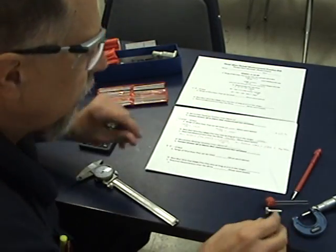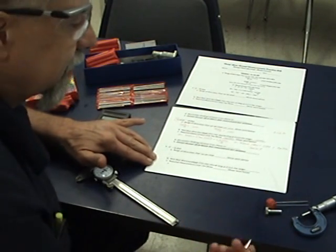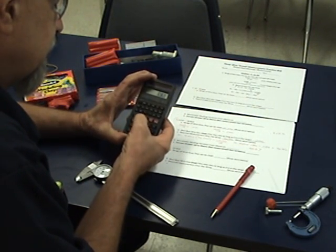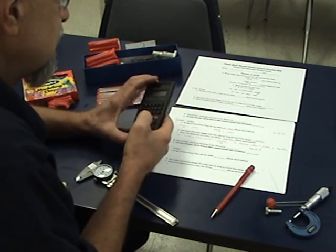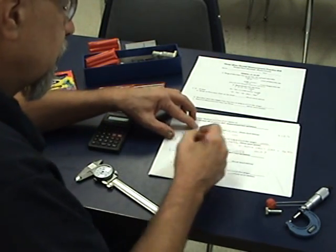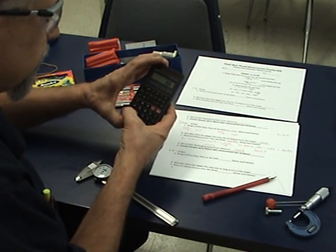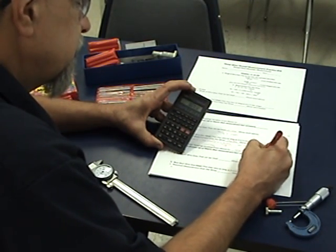The modeling clay is a great help in this situation. The measurement I just got was 362 thousandths and maybe 7 tenths — it does have a vernier reading on it. The actual answer should have been 363.5 and I measured 0.3627, so it looks like about 8 tenths of a thousandth difference: 0.0008. On question D it asks for the micrometer reading variation — how many thousandths difference. Now I want to convert that to metric: 0.0008 times 25.4 equals 0.020 millimeters.